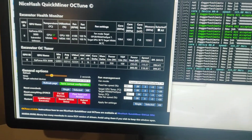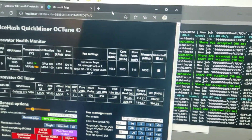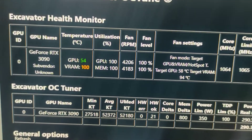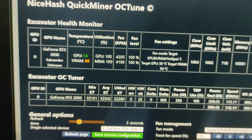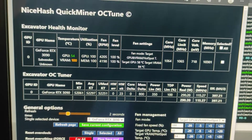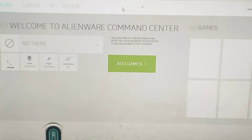Let's see what we can get with some thermal upgrades. Here are the final results — I'm getting 115, 114 mega hash, and it's currently going between 98 and 100°C on the VRAM. That's a good improvement. It's not as happy as my Founder's Edition that I was able to get down to 86°C with a thermal upgrade, but still not too bad. Pretty happy with that — at least it's not pushing 100°C plus.